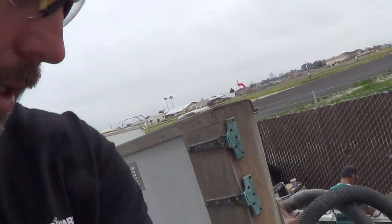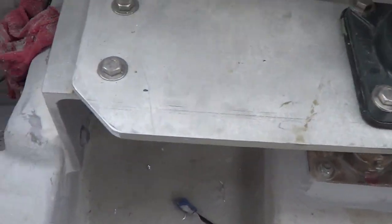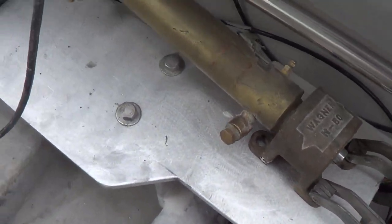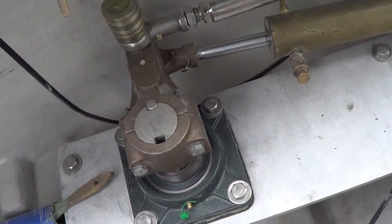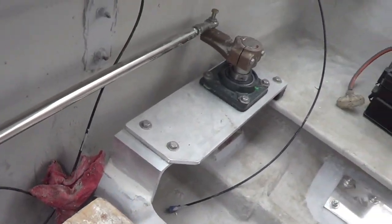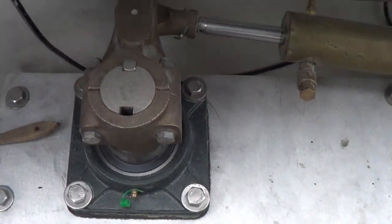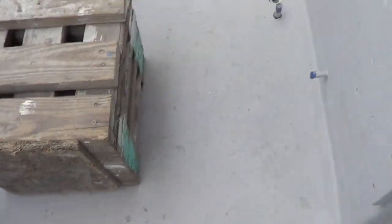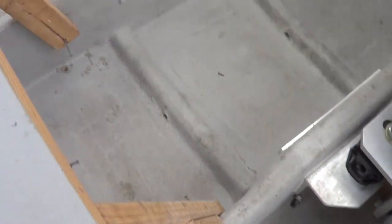We've got the steering system kind of mocked up here, pretty much getting there with the steering. You can see we've got the bearings bolted to the plate, everything set into the stringers. It's not assembled for the final time yet — we still need to drill for the ram here, but we're getting there, starting to take shape. We've got a nice tie rod going across. In this case we put the tiller arms pointed towards the stern just for clearance issues and room, because this platform is going to accept the generator. The generator was originally located up here between the engines, but we're trying to get as much weight to the stern as possible. So we built a nice big fuel tank here, we're putting the generator here, and we're going to move some other stuff to the back too — batteries, etc.